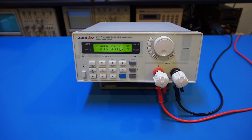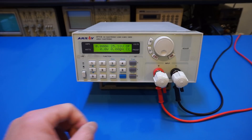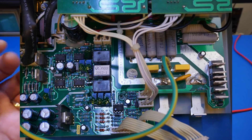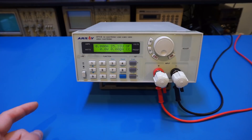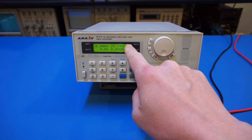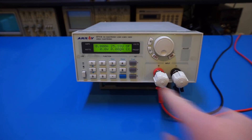You can probably hear the relay clicking. As I mentioned in my previous teardown video, there were three relays inside — two for switching the measurement ranges and one for cutting off the output via a bank of MOSFETs. Right now we're reading a readback voltage of 25.18 volts, and you can see that the electronic load is currently off and we're in constant current mode.